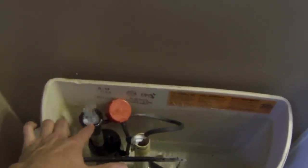This piece here — it's actually called a ballcock valve — has a little seal that fits right here, and this happens to be my problem. Here is the biggest problem with attempting to run your toilets off of rainwater, at least in a first-world country. Here is the seal that allows my toilet to run off of rainwater, and here is the seal it came with. They are virtually identical in shape. The biggest difference is this: the seal out of my toilet operates on eight pounds of pressure and is used in all first-world countries. This low-pressure seal starts to operate at just two pounds of pressure. Since I have about three and a half to four pounds of pressure, this fifty-cent piece determines whether my toilet works or not.